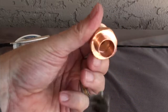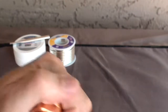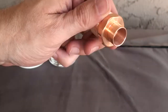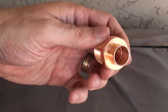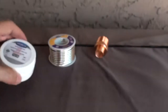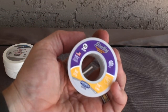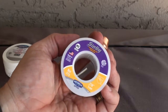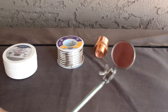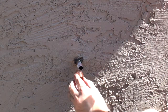I did buy a kit and it came with the brush, the solder, and the flux — I think I paid around $20 for it. Most of the fittings will be clean enough out of the bag, but it doesn't hurt to give them a good brushing and get rid of any spots you see. One other thing: I do have a mirror, and I use the mirror to be able to see the bottom of the joint to make sure the solder goes through.